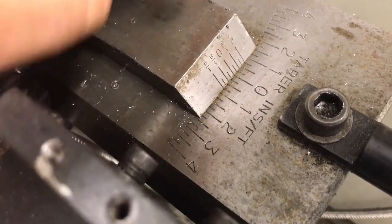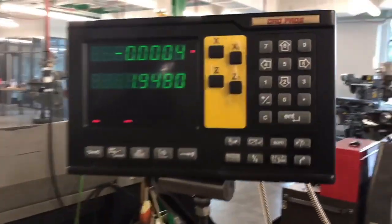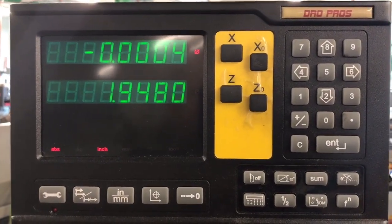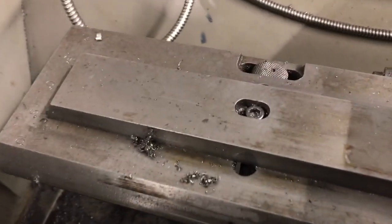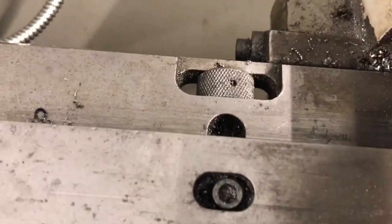It's going to be a little bit more than just verifying it here. I'm also going to need to use my digital readout to be able to tell how it's actually tracking. I have a screw here and another screw right here. I'm going to loosen those two screws up and then I have an adjustment wheel right over here.